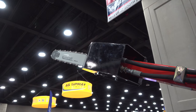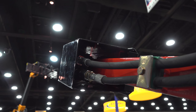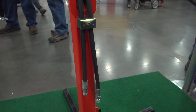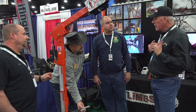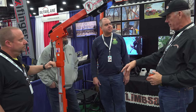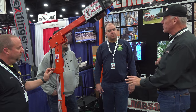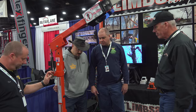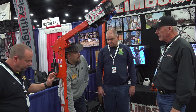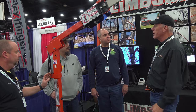Let me ask about the hoses. These look like half-inch. They're half-inch male pipe threads, but the hoses are actually 3/8. Can I get these in a different size, or do they come with couplers? No couplers — we never know what a guy's going to put it on or what length he needs. We run them to the bottom of the last window, and the customer is responsible for the hoses to their third-function hookup. On the 8-foot model, the hoses come out to that bottom window at 104 inches long.